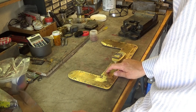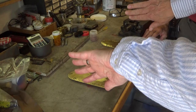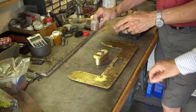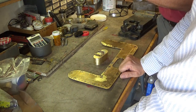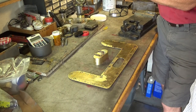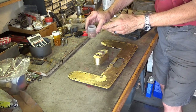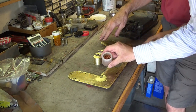One more question on the rivet: what you're saying is that that rivet is just holding sideways onto that panel — it's not a nut-and-bolt situation? It is actually squeezed. If you could imagine, this is the hole, and we have a V contour all the way around there. When we mash that shaft of the rivet down, it spreads out. And when it spreads out into that countersunk hole, you find that you are holding that rivet mechanically in place. It does not require solder.